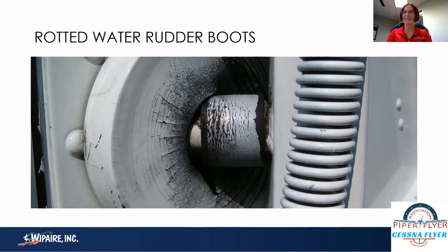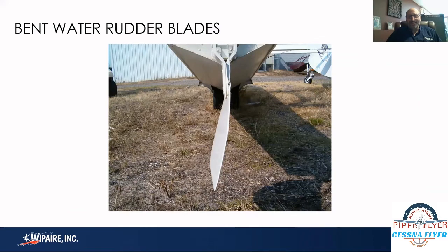Back in the water rudder area, the steering arm goes through the aft bulkhead of the float through a rubber boot that seals out the water. That's a common spot to crack over time — you can see it's weather-checked. Harsh environments cause this. It's a good check to make, especially if you're noticing water in the aft compartment of your float. Simply deflect the water rudder left and right with your hands and that will reveal itself pretty quickly. It's more prevalent on floats stored outside getting UV damage and temperature cycles.